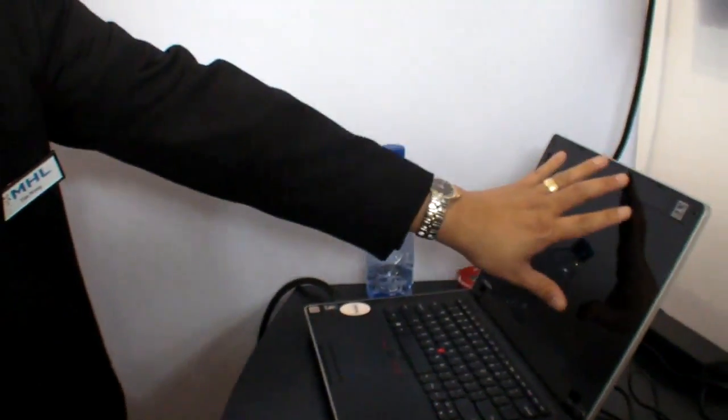If you want to dock something into a laptop kind of thing, only HDMI is being used and the keyboard would be Bluetooth. Or the device would need another USB host. Even for laptops, we've talked to two laptop makers who are talking about having another power button just for the monitor, because they want to have MHL in — so you connect your phone to the laptop, turn only the screen on, and use the bigger screen of the laptop. There's a lot of uses for MHL coming out.